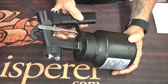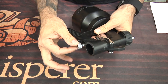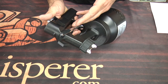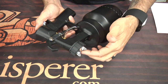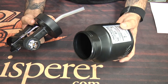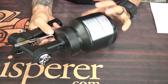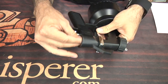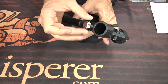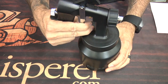Let's look at the Rockler gun. It's capable, but clearly it's all plastic — a few metal parts, but the majority is rigid plastic. You've got a flow control knob on the back — that's pretty standard — and the ability to adjust the fan orientation from vertical to horizontal. That's really about it for adjustments. Your needle and cap set is interchangeable with other sets, and you have a plastic canister. I don't really like plastic — I prefer metal — and I also don't like the threads; if you get a lot of gooped-up finish on there, that can create problems reassembling. The air hose comes in at the top above your hand, which could be uncomfortable and might block access to the flow control knob.